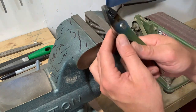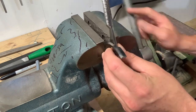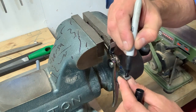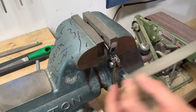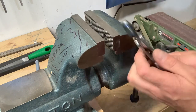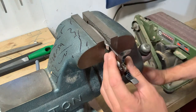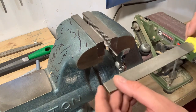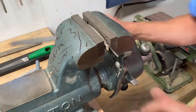Let's look at the matchup now. Beautiful — the only place that needs to come down now is the center of the jaw. My back and front are good, but I've got a little bit of a high area right here in the middle, so I'm going to file that away with light pressure. Same thing on the other side. I can actually see a little hump in the center of this one — I'm high right here. That marker trick is a good trick.